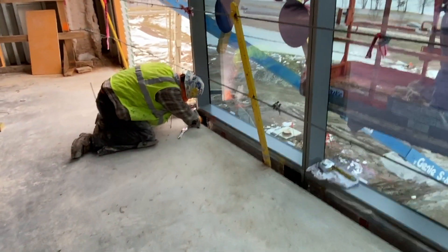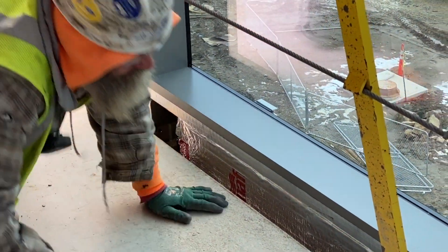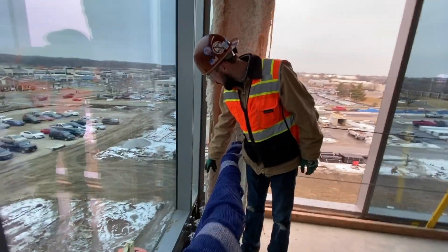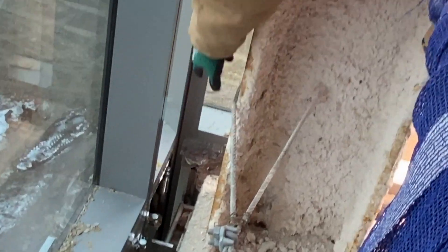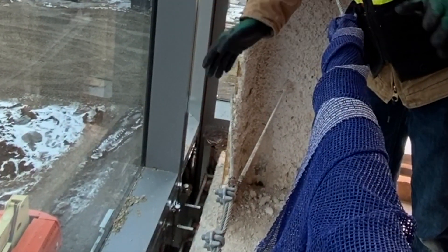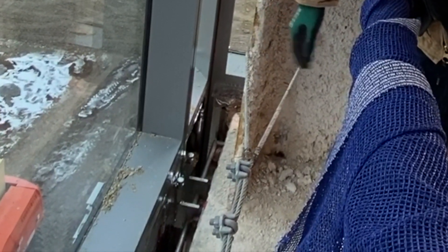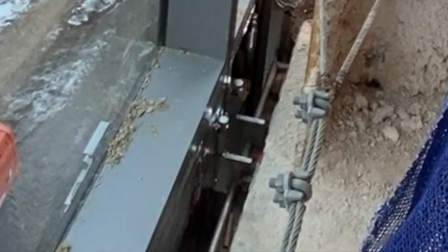You can see down in the corner the j-edge is mitered each direction. We have this corner going north-south and this corner going east-west — the j-edge is mitered in the corner so you can use a mitered clip. This mitered clip is typical throughout every floor all the way around the building. There are no custom clips for corners or odd geometry — it's a square corner and you use this square bracket attaching to the j-edge. It's a very simple setup.